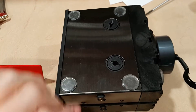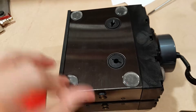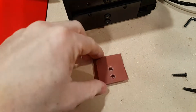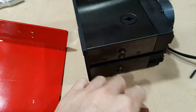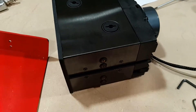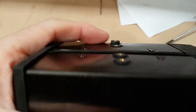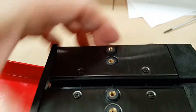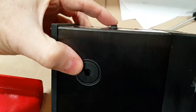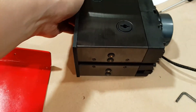In order to reduce vibration, I added these little rubber stick-on feet to the bottom of the reservoir. I also made these little gaskets out of gasket material to go on the sides to better hold the reservoir in place. These little rubber grommets, as you can see, can essentially reciprocate in and out, and I just wanted to improve the fit there to hold the reservoir in place better.